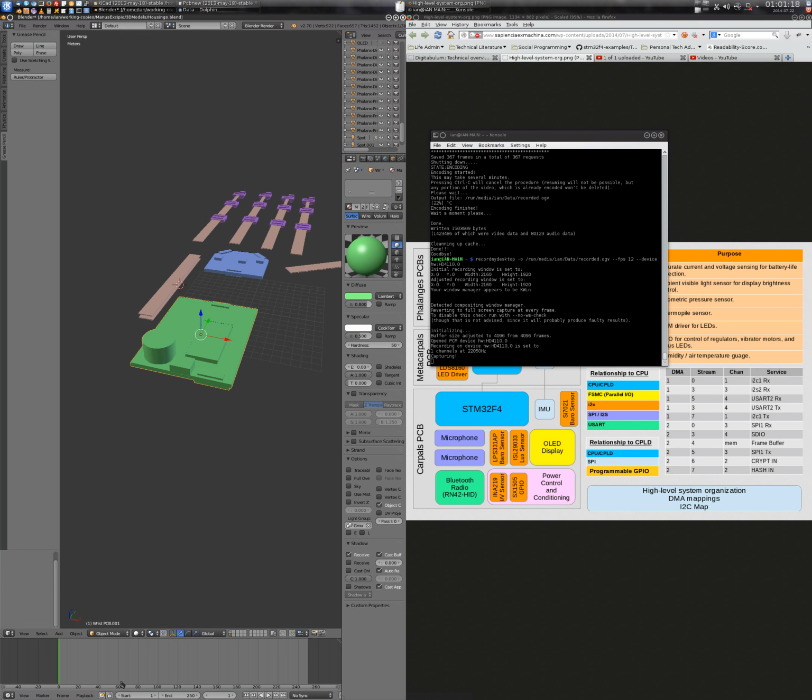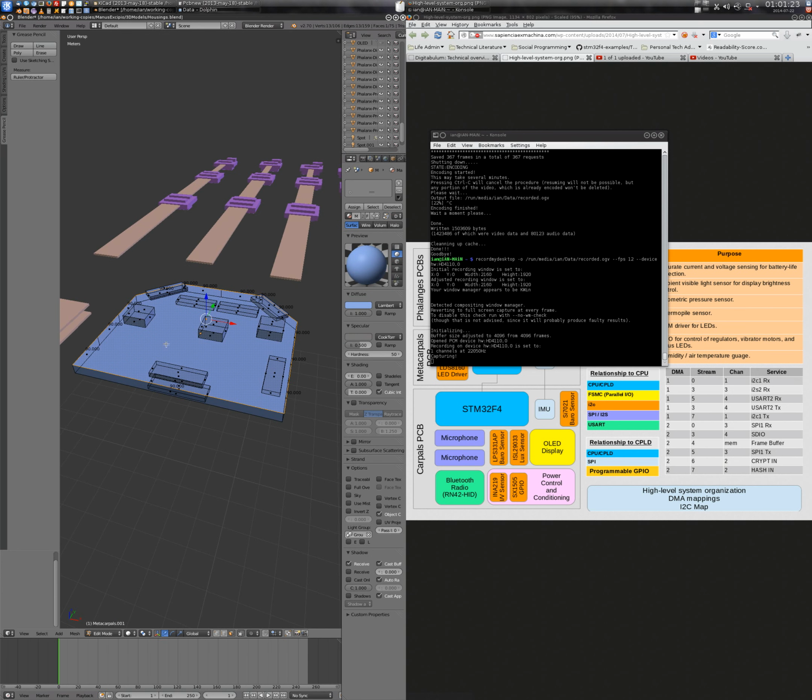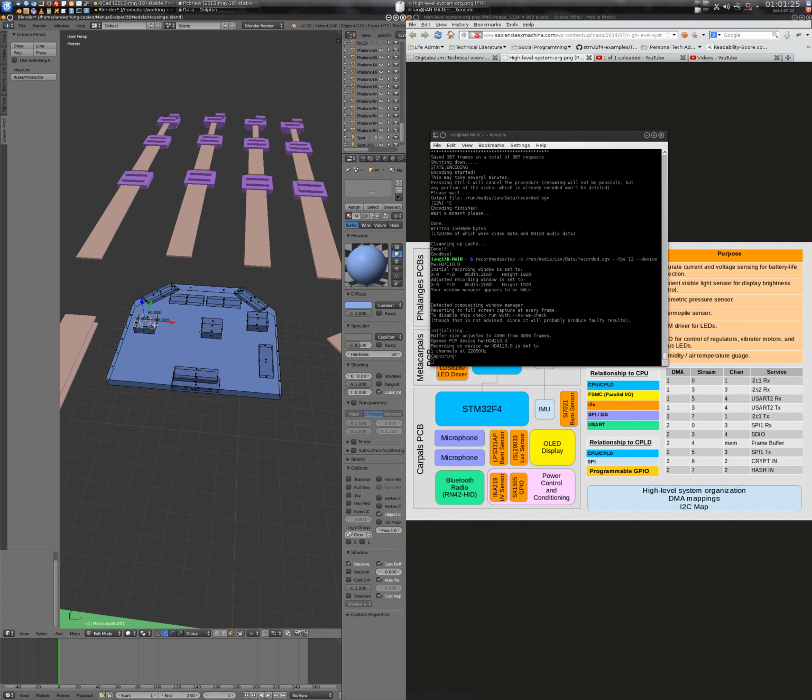Over here on this periwinkle PCB, I have these different cutouts. This one is where an IRDA receiver goes, and right here is for the IRDA transmitter, which is a pair of very high power LEDs. I disqualified all of the existing off-the-shelf IRDA PHY transceivers, partially because their emitters weren't powerful enough, but also because the pre-rolled PHY puts unwanted constraints on what I can do with the IRDA peripheral.